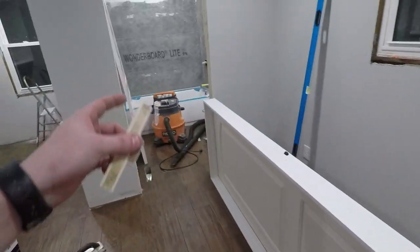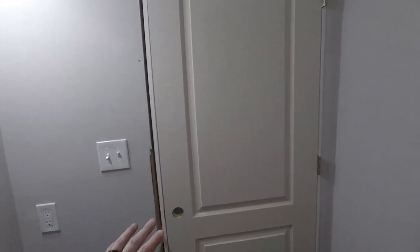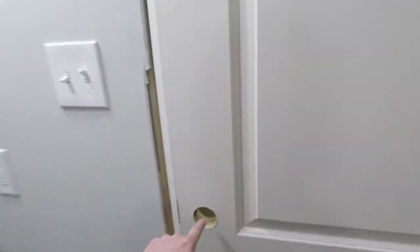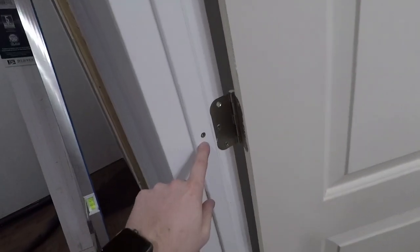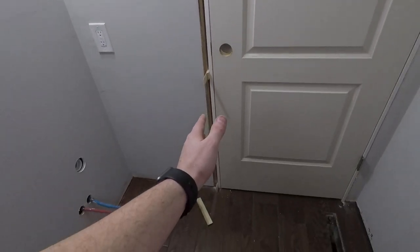I've got my piece cut off, so I'm going to sand this up and hopefully we did a good job. Inside the bathroom now — I've got the door set in here. This wall was perfectly level and perfectly straight with no bow in the board, so I just screwed it directly to it, and the bottom just needed a tiny little shim to get this perfectly straight — that's where the really long straight level comes in. I put in a couple of screws right near the hinges — top, bottom, and near the middle hinge — in this flat spot and then just fill them with putty. The left side you want perfectly straight up and down and level; the right side you set based on the gap of the door.